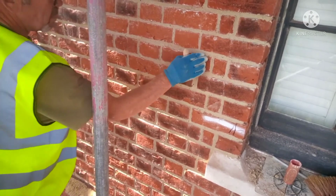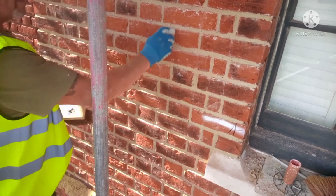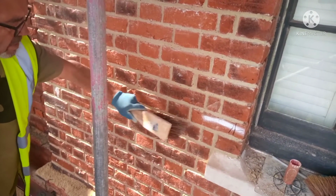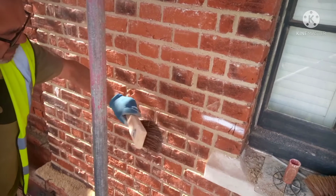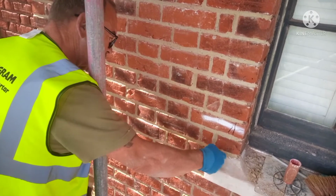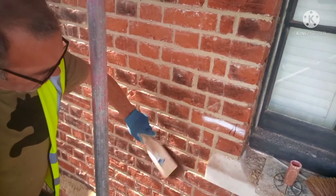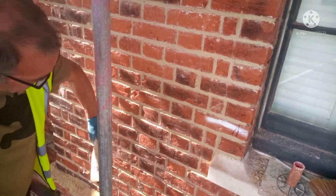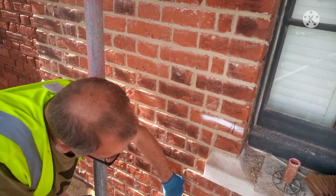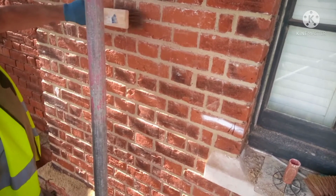And when I say dodgy, I mean you've got bricks that are spalling at the edges, and the churning process is a really good way of blending it in. It's a dying tradition, churning. I think there's only a few that do it. There's a few good channels on YouTube, you know, good old builders. So don't overdo it, don't smash it, gently does it, little flips.